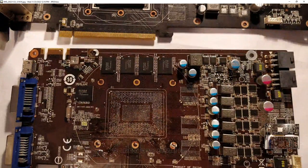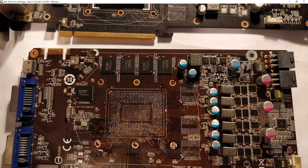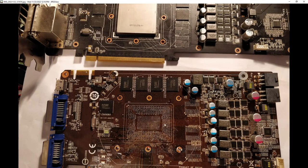I did find one — it's this MSI card. I don't even know what it was at this point, but it might be a 560 Ti, or a 460, or a 560 — some 60-series card. I've had it for ages. The original plan was to turn it into an ePower, but the PCB power-plane layout is not ideal for converting it into an ePower, because there's lots of easily accessible vCore power plane but no ground.